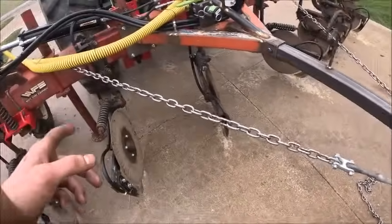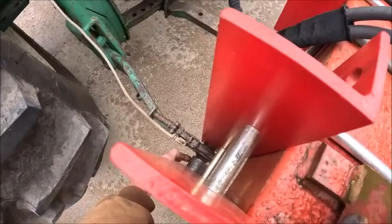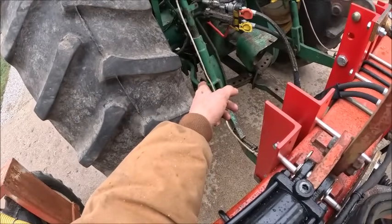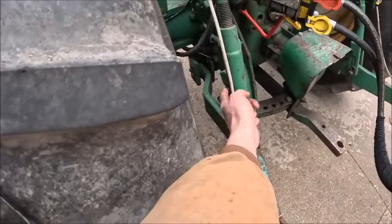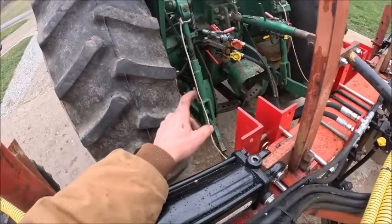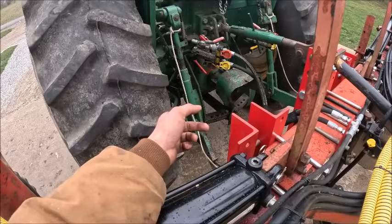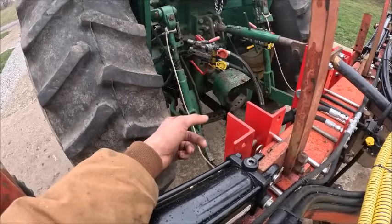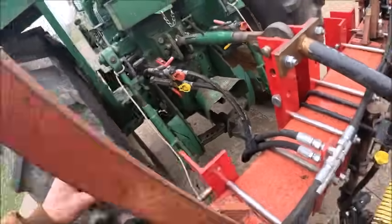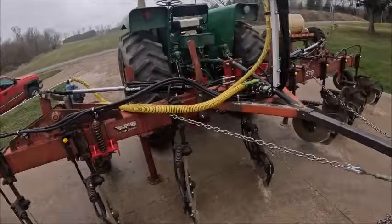Just to see how things went, I made my first chain. I got my spacer blocks, or my spacers, put in on the 3-point. The one thing I'll still have to do, I didn't know that Dad had made narrower spacers for behind the sway plates on the arms. It's either for the 3-point or for the snowblower or the stump grinder. So I'll have to put the correct 1-inch thick spacer plates on there, and then that should take up the vast majority of the rest of the slop in the 3-point. But we already improved it greatly getting the hitch balls where they need to be.